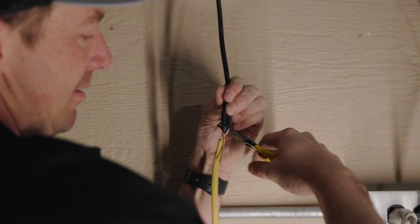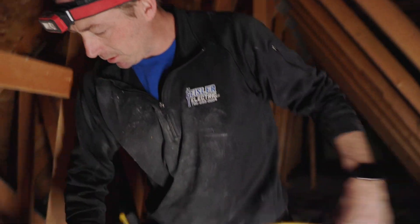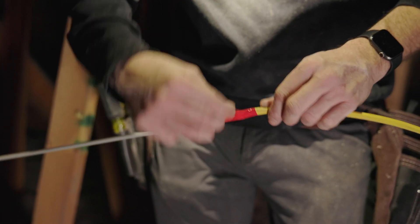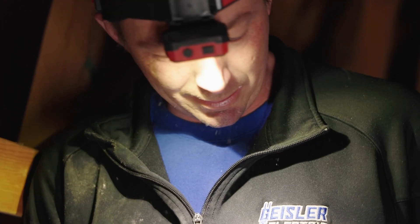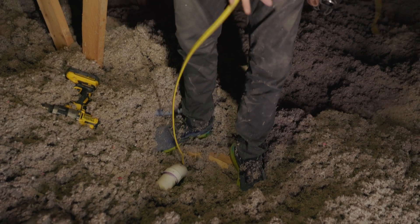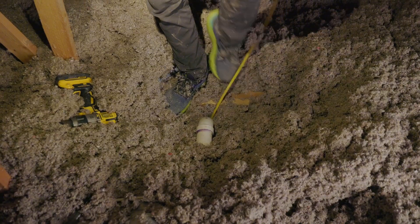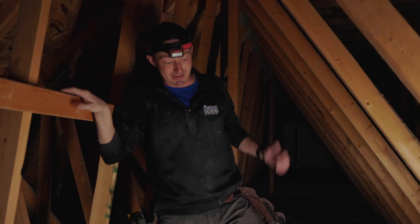This is the wire I tied onto that conduit in the basement. I pulled up quite a bit while I was over there, and now I'll be able to tie onto this fishing pole and send it down the wall. Tip: if you're ever fishing a wire and you like the person you're working with, leave a tail — that way they can just unwrap it once they get it down there. Once I can hit the hole, I can tell he has a hold of it. Once we confirm he's good, I'll have him pull some back. We don't want to trip on anything, so I'll go over to where that conduit is and staple it up. That's a wrap in the attic.